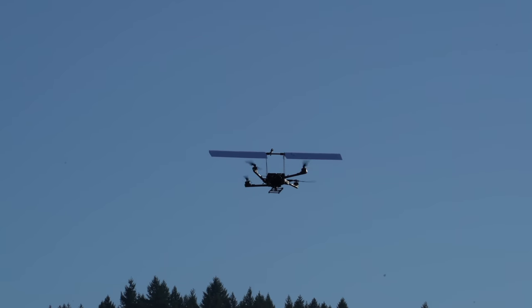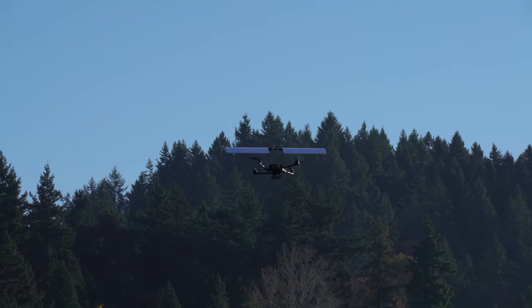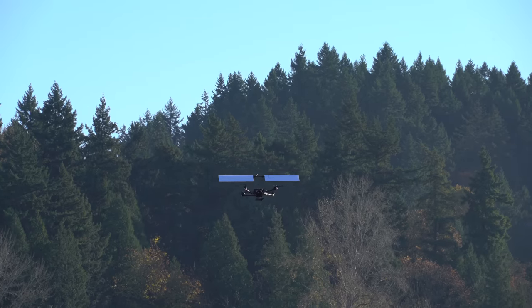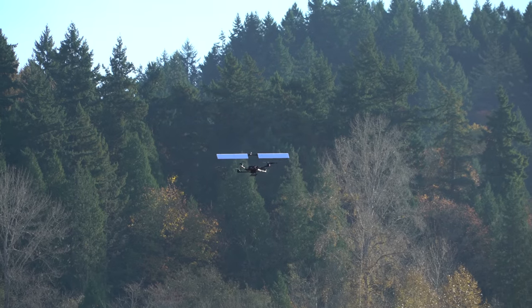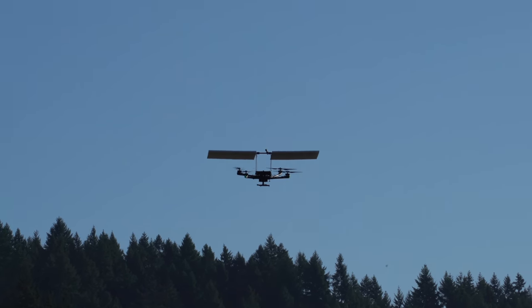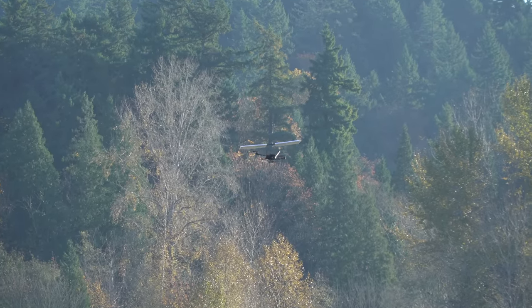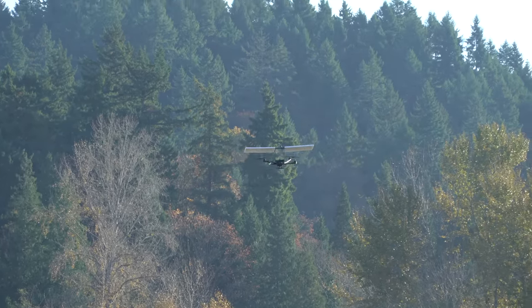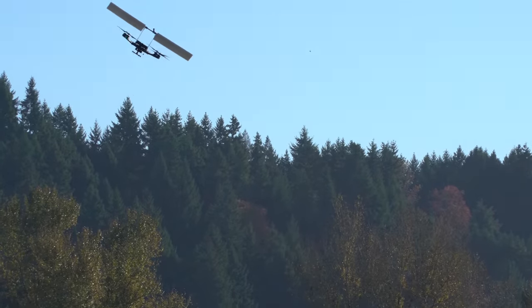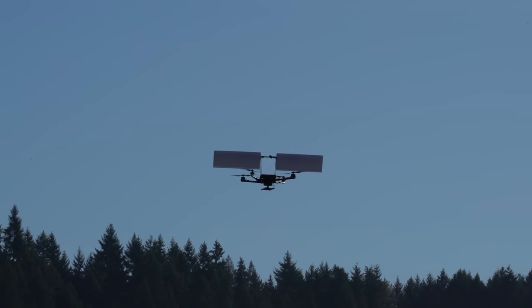It's hard to say, but it kind of looks like the wing isn't even hitting the hard stops right now. The oncoming airspeed might not even be high enough to push it back all the way, and the props are probably sucking it down quite a bit, so it might not even be flying yet. The angle of attack looked about right for a moment — but then it just got nutso and I killed it. That was getting crazy!